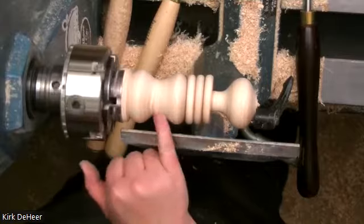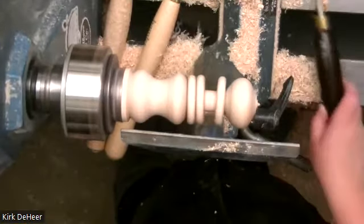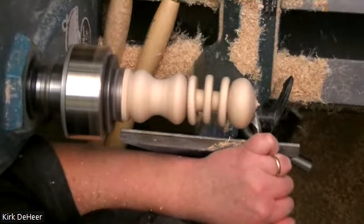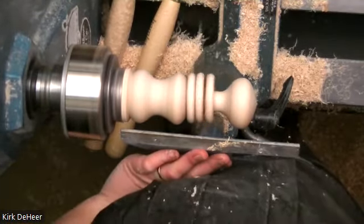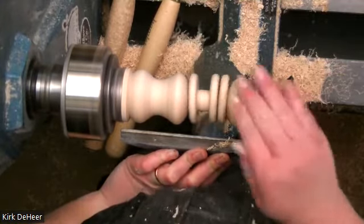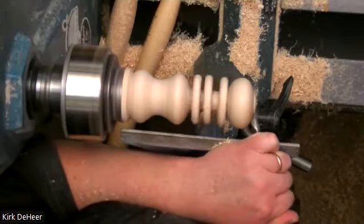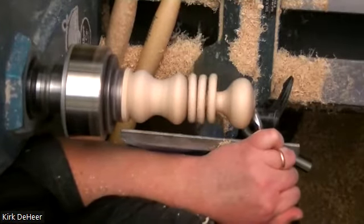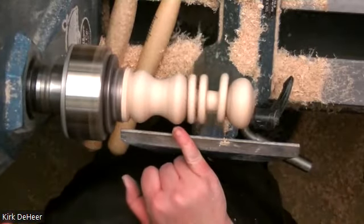I'm moving my stuff so I can move the tailstock out of the way — we want to get to that so it looks nice. We've got this open so we can work with it. We will sand this all up in just a minute, but we're going to round this over so we have a nice round head to our rattle. Turn the lathe back on — you can move the tool rest if you're more comfortable with that. I just continue to roll that bead across, remove the material just a little bit at a time. I've got to stand up on my tiptoes because his lathe is taller than mine.